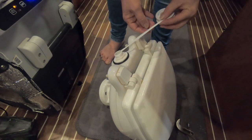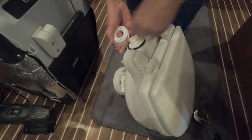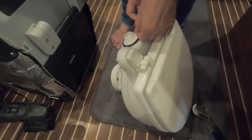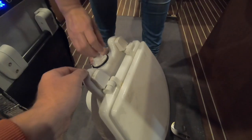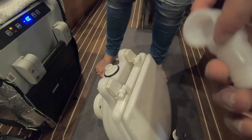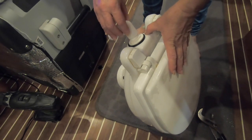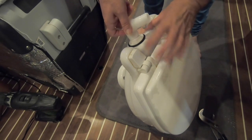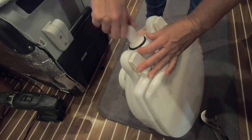It's just got twisted. PTFE tape's a bit like that. That'll do you. Well done. Does it just break? Yeah, just pull it. That's it. And then that tail end there. And then this elbow screws on. And if it's not exactly in the right place, it will actually turn round because of that rubber gland.